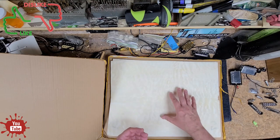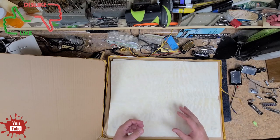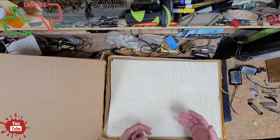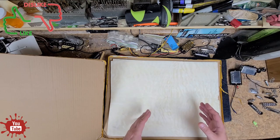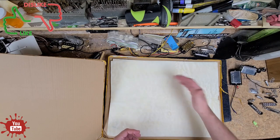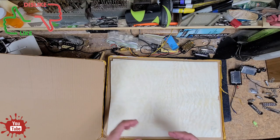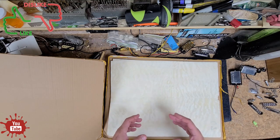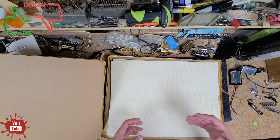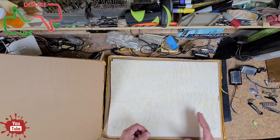So I'll end up putting the veneer on the wood, gluing that down, getting all the bubbles out, putting some weight on top of it, using either freehand or making my own template of the design of the guitar body that I want to use or build. Get that cut out and finished around the edges, okay? And before I do any drilling or any routing, I'll have the neck pocket cut out on it. But the pickup cavities, the control cavities, where the bridge is going to go and everything else, that will be done after all the epoxying and stuff is done.